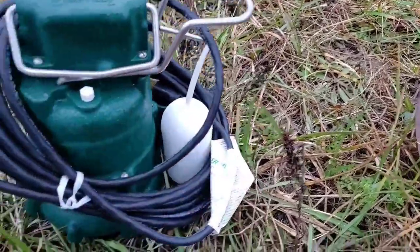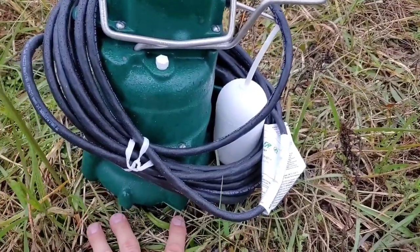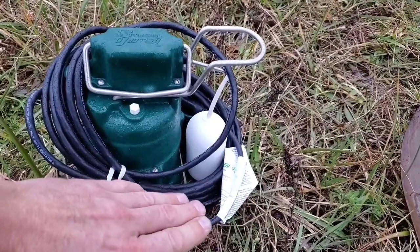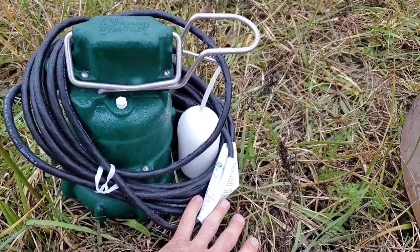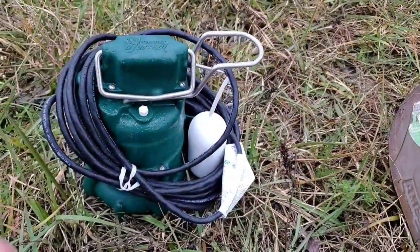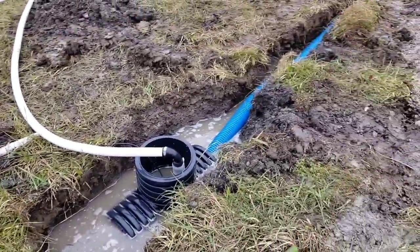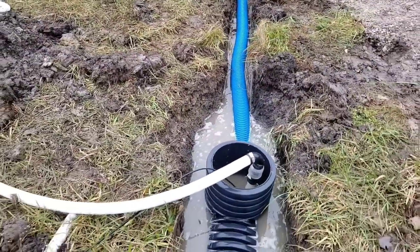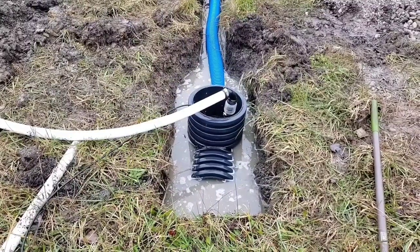That's 10.5 inches. Plus you got a couple inches, because you got to remember, the sump pump is sitting on a housing inside a sump pit. So basically what I'm trying to say is you need to make your sump pit a full 12 inches deeper than your trench, okay? So if the trench is 12 inches, then you can do a 24. If a trench is say 16 inches, you need to go up in size. You have to do a 30 inch.